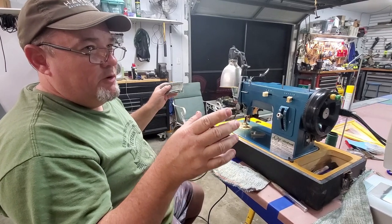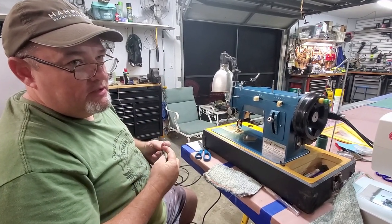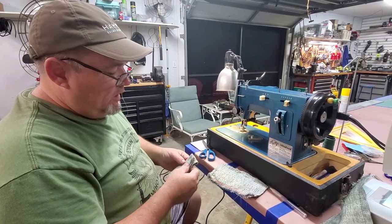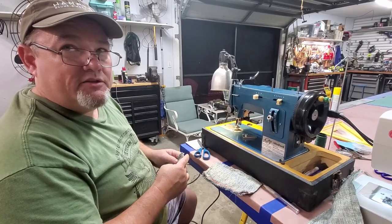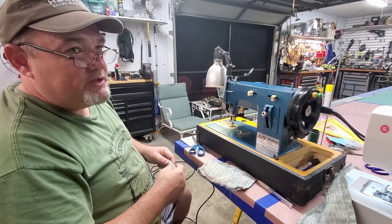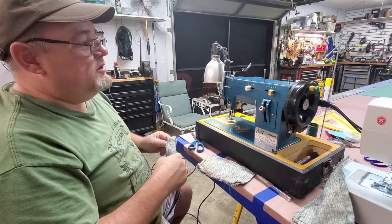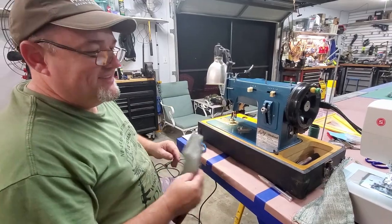In the aft canopy, the most aft supports will also have heavy duty aluminum and a hook with block and tackle so we can hoist up the dinghy and also hoist a swimmer — for example with a life sling. I've seen these little hoists rated up to 200 pounds, but I saw one installed on another trawler and it was pretty flimsy — I wouldn't trust it in an emergency. So I want to build something that supports our canopy, our anchor light, and other things, but can also do real work. We'll document all of it.